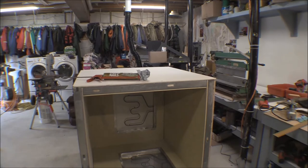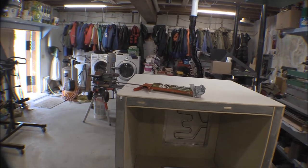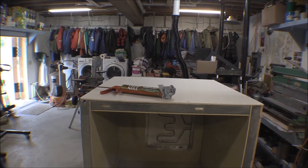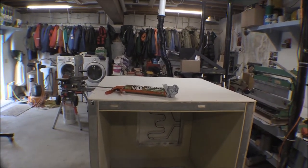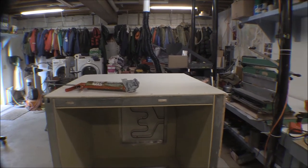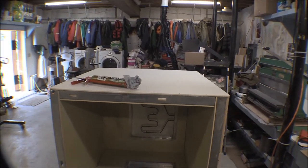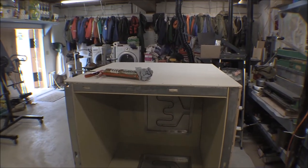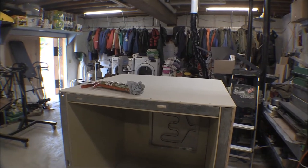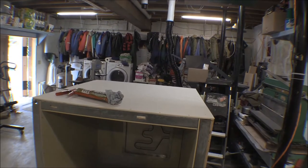I put sheetrock on the right side and got the plywood down on the bottom. I insulated that with fiberglass insulation and then cut a piece of sheetrock to fit on it. Because this thing flexes a little bit and will move around, an ordinary wall doesn't move so sheetrock screws hold fine, but this thing still has some flex. The plywood makes the bottom pretty rigid but it doesn't help the joints between the tops and sides. The cement board isn't tied into the top or sides, so that doesn't add rigidity either — the individual frames are rigid but the whole assembly isn't.